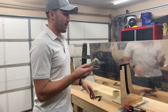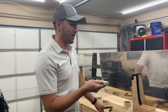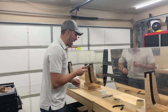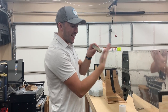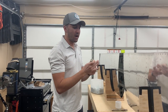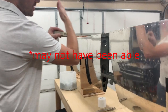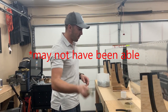When it comes to these bucking bars, they're not cheap — it's tungsten, about a hundred bucks for this little piece of metal. When you buy the kit you can get a more generic cast steel version, but it's not nearly as dense. This tungsten bar was crucial here. I don't think you'd be able to do it with a steel bucking bar, because this angled portion here matches perfectly for getting to the rivets in tight corners. Make sure you get one with that angle — if it were a perfectly rectangular piece, you wouldn't have been able to reach the bottom rivet where it meets that corner. The tungsten bucking bar was essential.